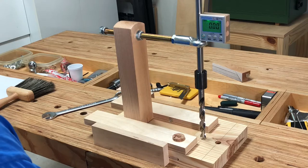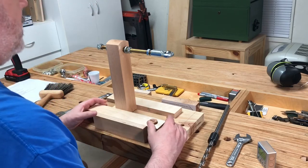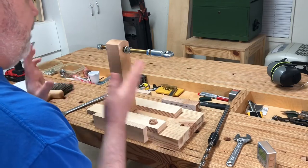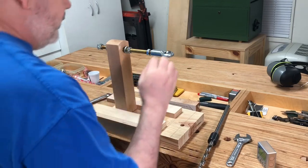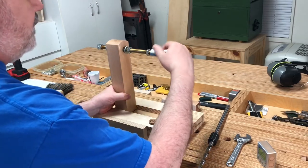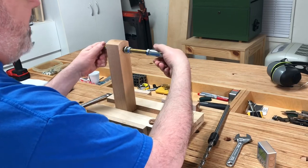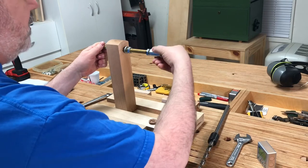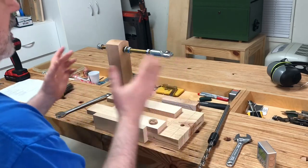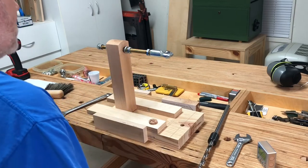Since that first example went so easily, let's say we've lost our marks and we're trying to get this thing back into calibration. The first thing is the rod end bearing. The way I like to do it is I actually screw the rod end bearing until it bottoms out and then I back it off two turns — that's half a turn, one turn, one and a half, two turns. That gives me some adjustment up here if I need it as I'm calibrating.